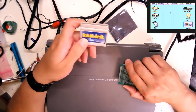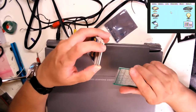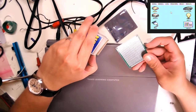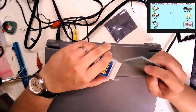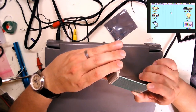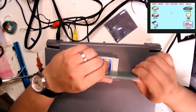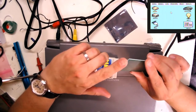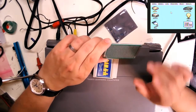What I want to do is, first off, try to get some of the software off these cartridges because there are no real copies of them anywhere. I've got to make a bigger version of this, an edge connector. This uses 100 thousandths spacing. Pull the cartridge out, put in a suitably chopped down cartridge, this little guy, in its place, bus across it, and then hook in the IOs of a Raspberry Pi and monitor it.